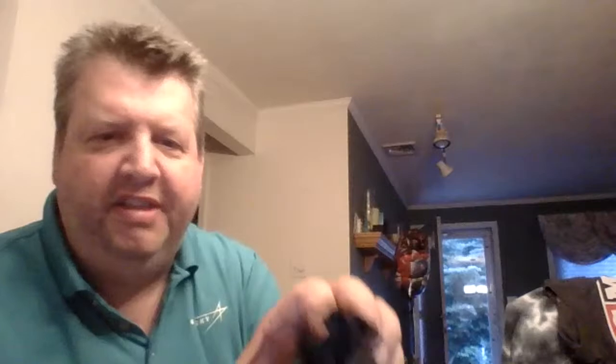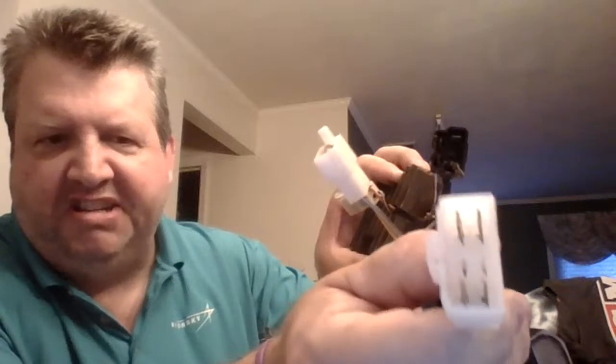I'm not going to give them the new one — I'm going to put the burnt one back in and just change the connectors to make sure it connects correctly. One thing I noticed on the Scag: the connector is weird. The new one is a six-pin Packard 56 connector using only the four outer pins. The old one has four going straight up and down and two going sideways. I'll only disconnect the one burnt stator lead, put a good quick-disconnect terminal on it, and that'll be that.